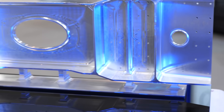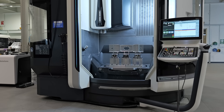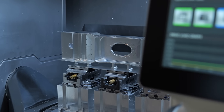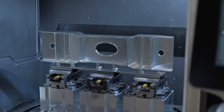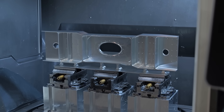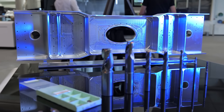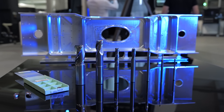The reason behind this demonstration was to take a larger part from a larger machine and put it onto a package machine — a 95 monoblock — and show the greatest capacity of such a small footprint. One of the issues is purely down to the closed pocket. Because of the full five-axis configuration and the stability of the part, you can remove the material, give a good semi-finish, so you've got a true finishing amount of material rather than an overly varied one. That means you get a better quality of part and a reduced cycle time.